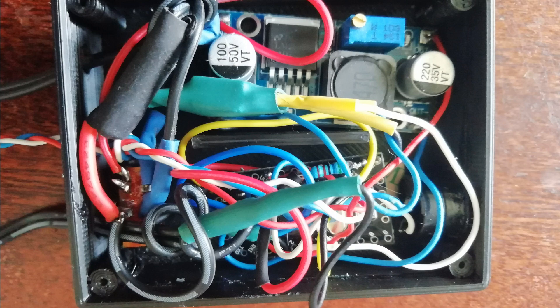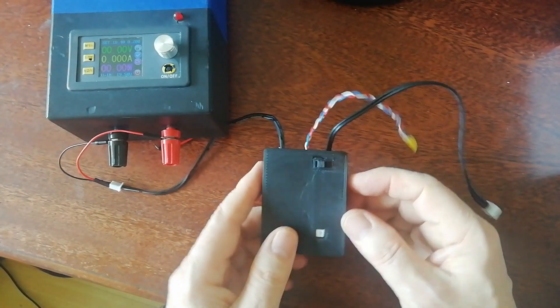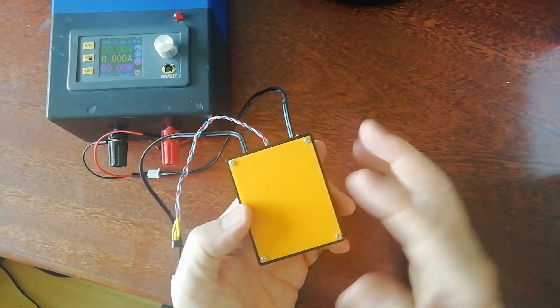In other words, the alarm triggers when the fan can't cope. There's a digital temperature sensor which feeds into the board, accurate to plus or minus half a degree. There's a MOSFET sealed in shrink wrap which controls the output line going back to the fan, which pops out on the other side of the box.